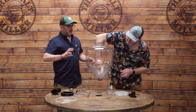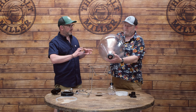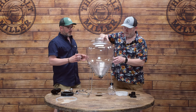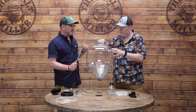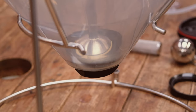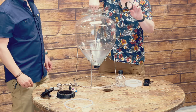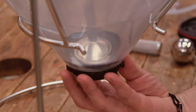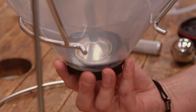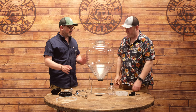Keg King instructs you to turn it over at this point and fit the screw, but we're not going to do that because it can be tricky to get the threads to meet — you need a little bit of pressure on the internal part. So we'll use a secret weapon: the thermal well and plunger. Put that inside — it's got an O-ring on it — press down on that to give even pressure, then fit the external piece with the teeth on it. That gives you an even pressure so you get a nice thread without cross-threading. Now we know we've got a good seal in there.